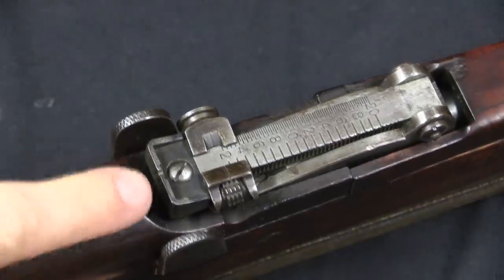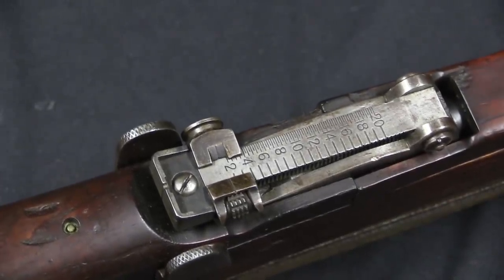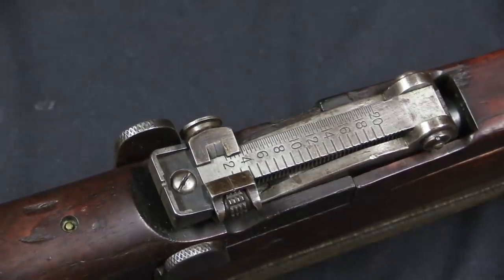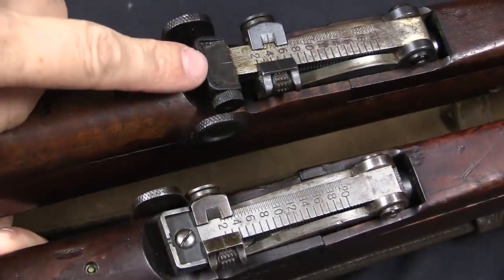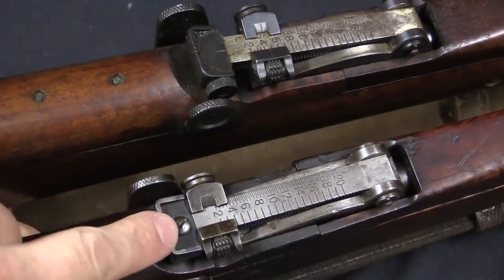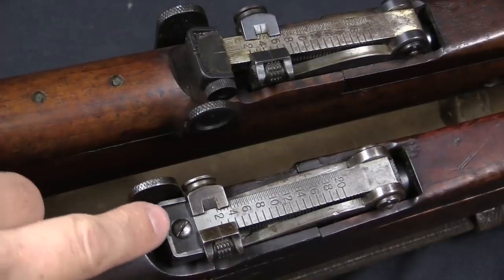Now, what can we do to simplify these rifles without really impairing their combat functionality in the modern warfare we now recognise from the trenches of France? The first thing we can do is get rid of the windage adjustment. You do not need one minute of angle click adjustable windage on a rifle that you're using at relatively short range, often in the dark, under machine gun fire on the Somme. So the rear sights were simply screwed in place in lieu of the original adjustment mechanism. Here is our original Mark III with the windage dial on the side. Here the dial is gone, and there's just a screw that locks this piece in place. The actual rear sight notch continued to be used — it was the same component, just fixed in place.